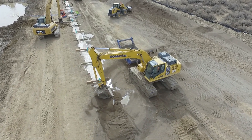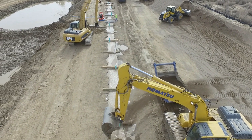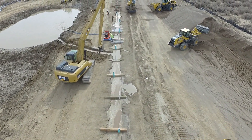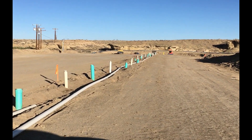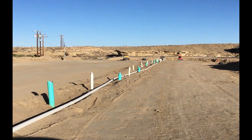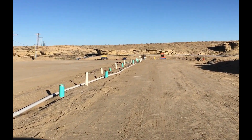As gravel is placed at the surface, it advances the submerged leading face and displaces the polymer slurry into a disposal pond. Finally, the slurry is broken and circulated using electric submersible pumps in the temporary wells, and the trench is now ready to collect groundwater.